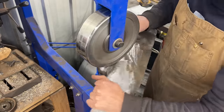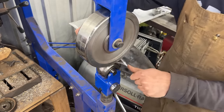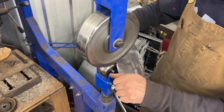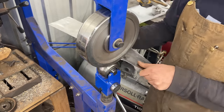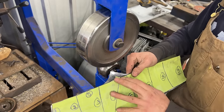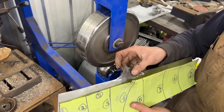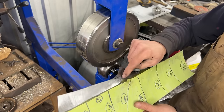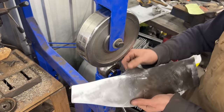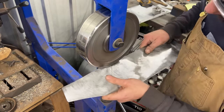For now, the shape is not important. For now, it's important to give it the correct amount of surface in certain areas, you know? Okay, if we cut it, we can do that a little bit on the stretcher. We can go and stretch just the edges here, but I want to keep trying here because the stretcher tends to rip it when it overstretches.